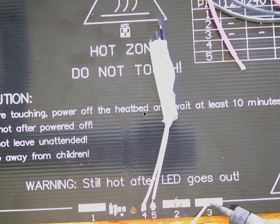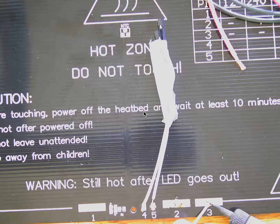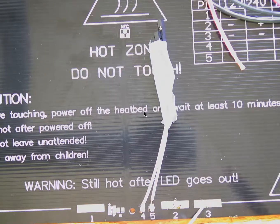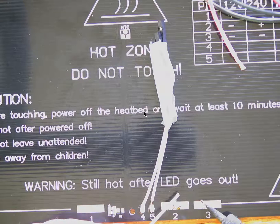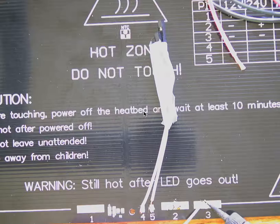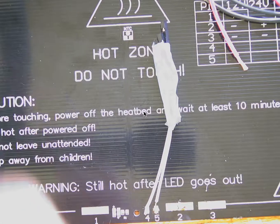And my soldering iron has had some rough life, so you want to have probably a pretty hot soldering iron, maybe the fatter solder, to get good adhesion. This is kind of ugly, but we'll see if I can get it to work. Okay, so tinning the tab, getting a good solder connection to the tabs to start with.